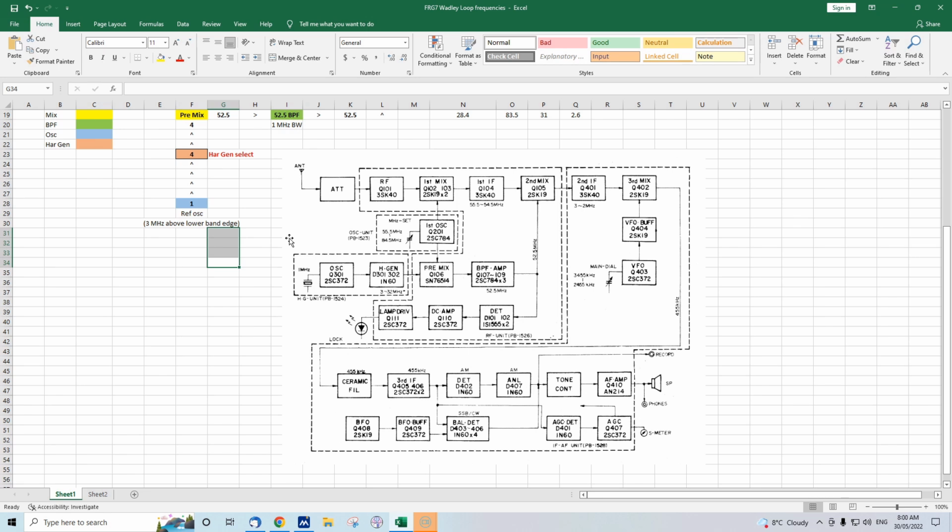Then from the mid-70s you had the Drake SSR1 and the Yaesu FRG-7, and the latter in particular was very, very popular. It gave many shortwave listeners their first really good performance communications receiver. In fact, it was pretty much a communications receiver, but for consumer, amateurs, and a bit more than casual type users. And one of the benefits of that is things like frequency display, because all your frequencies could be tuned with your 1 megahertz band.